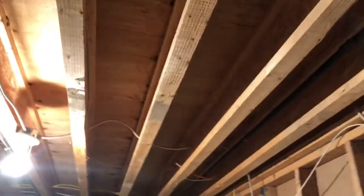That also being said, something that I've always practiced, and it's kind of, again, self-explanatory, is to take a look at where your joists are. So we'll come back over here, see which way they're running, see if they change, see if there's any abnormalities in the joist layout. That way you'll know where to screw.